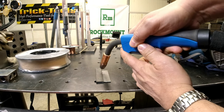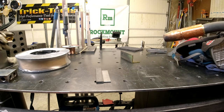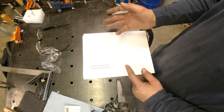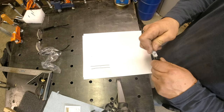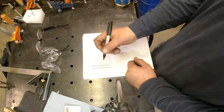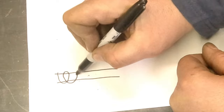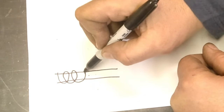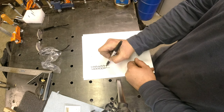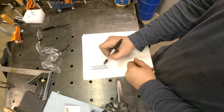If I was welding into this piece of angle, I'd angle back and angle into the joint. For the butt joint it's going to be angled back but more vertical. You'll work on your technique the more you weld. When you're running your welds, there are a couple of patterns most people use. One is like a cursive E — everybody runs it and it slowly works its way down past the seam. You can pull or you can push.